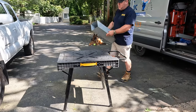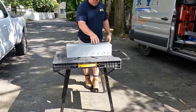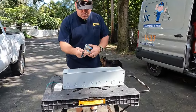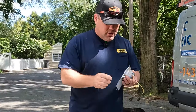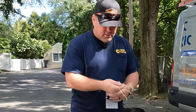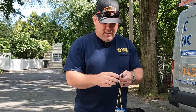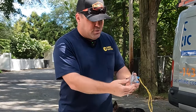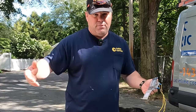I want to use this six inch trough and put the wattmeter on here along with the power back. These are little current transformers, and these current transformers are what allows the wattmeter to operate. The ungrounded conductors from our portable generator pass through here, and these CT probes measure the amount of wattage going through each leg so you can see how much power your portable generator is actually throwing out.